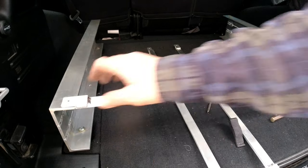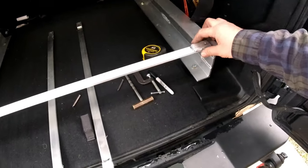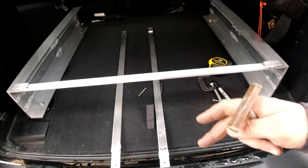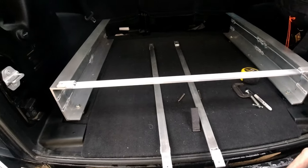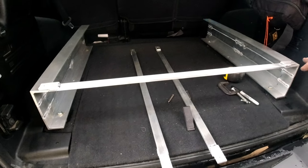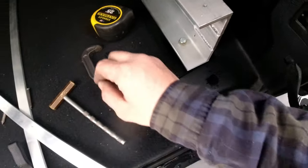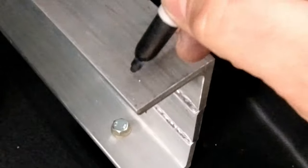Location is everything. I'll set it on top — now it's going to go under it. From here all I have to do is just tap it from the top and I'll countersink it from the top. That gives a good location to drill by.